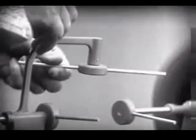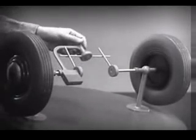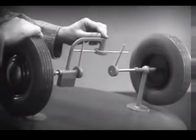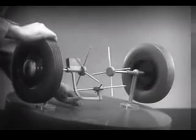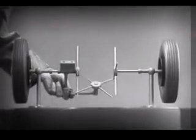Let's put this bar on a pivot so that it can swing in either direction. Now the bar can still turn both wheels at the same speed, and because it pivots, it lets one wheel turn even when the other is stopped. But if turned too far, the bar will swing around until it won't drive the spokes that turn either wheel. We need another crossbar and more spokes to carry on the job. When we stop one wheel, the crossbars will continue to push the spokes of the free wheel around.